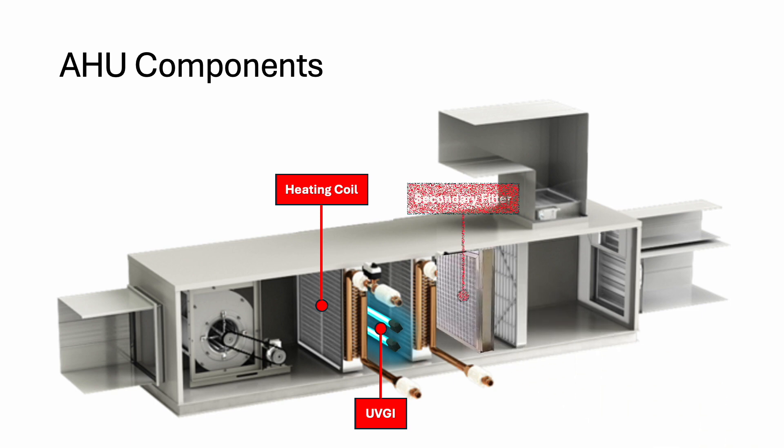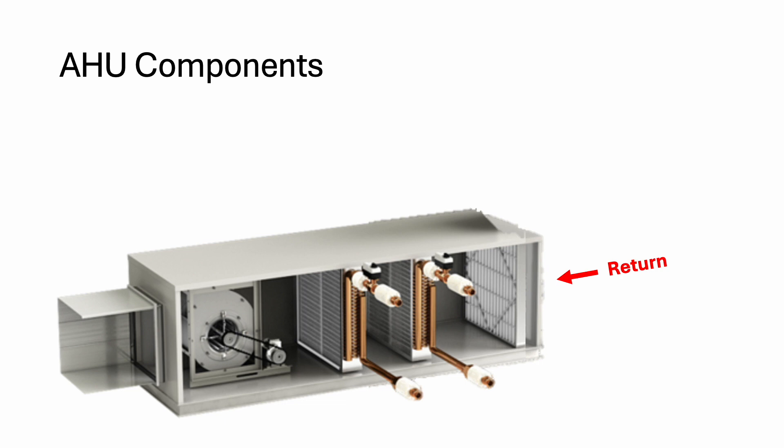We can also add more filters — for example, an electronic air cleaner, called the secondary filter. So you have the primary filter, and after that you have secondary. Some secondary filters can be pocket filters or bag filters. This type of application is mostly where we need cleaner air, for example hospitals or operating theaters where surgery is performed. Sometimes because you add a lot of things, the AHU becomes longer and longer. If you want to save space, we can use what is called free return — the entire AHU room becomes the mixing chamber. You throw the return air into the room and everything mixes inside the room, then the AHU freely sucks all the air to process and supply.